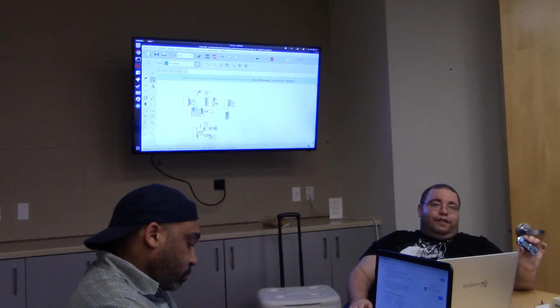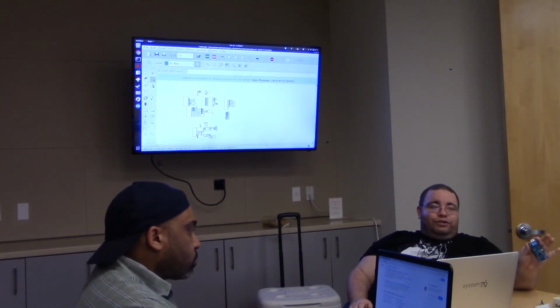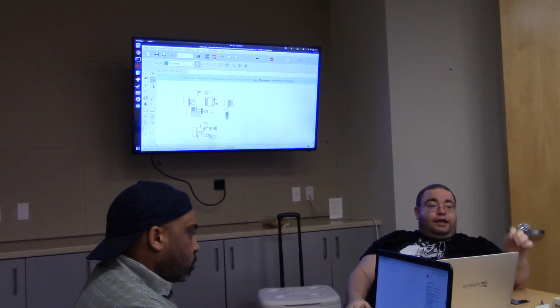It turns out that the human eye sucks at seeing blue. We are less sensitive to seeing things that are blue than we are to seeing things that are red, than we are to seeing things that are green. We really like seeing green, and to a little bit less of a degree, red things. Blue things, if all you can see is blue, it's going to look kind of mushy and blurry to you. The JPEG format uses this to great effect. It will do 1/4 of the resolution at blue that it does at red and green. And you can't tell.